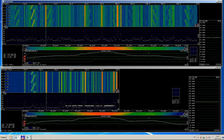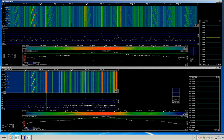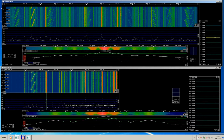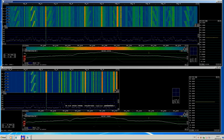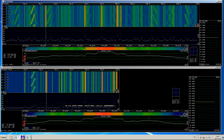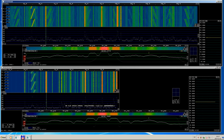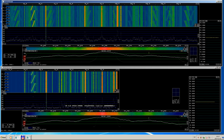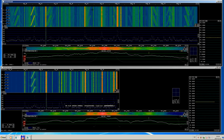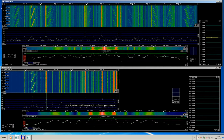The big difference between these two systems now is the big number of false signals in the BladeRF. You can see here between 93 and 94 there is a forest of lines, and also here around 98 and everywhere actually. And it is also easy to see the sweep generator with its characteristic pattern. It has these false signals 1 megahertz away and something here at 96.2 to 4 or so.